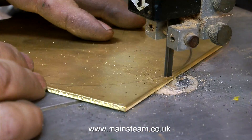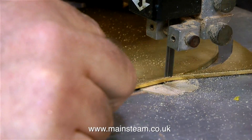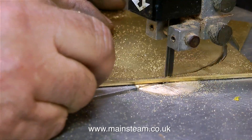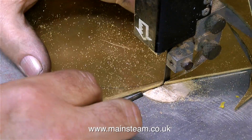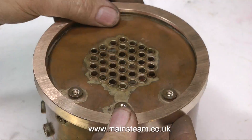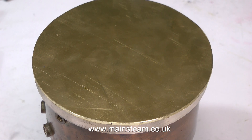Having marked out the piece of 3mm brass it's time to cut it out on the bandsaw. This is only a rough cut because I'm going to be turning the whole assembly to get it perfectly round. I notice the bandsaw blade is getting blunt — when it starts to wander of its own accord it's usually time to replace it. A health and safety warning: when using a bandsaw, wear eye protection and keep your fingers away from the blade. After finishing the cut I put it on the belt sander just to tidy up the edge. It really doesn't matter what it's like around the edge — it's only like this so I don't cut myself on the sharp edges.